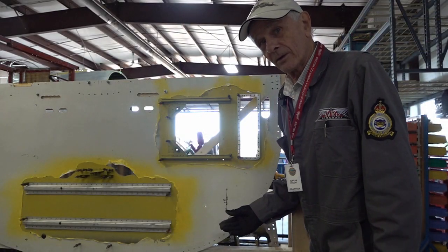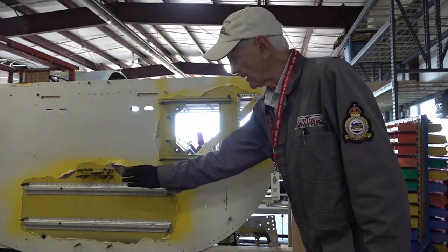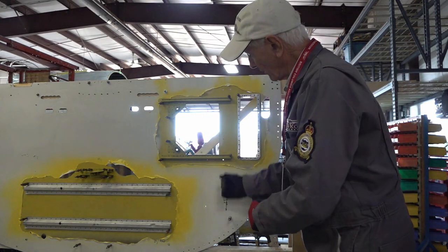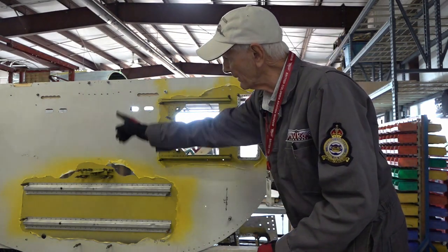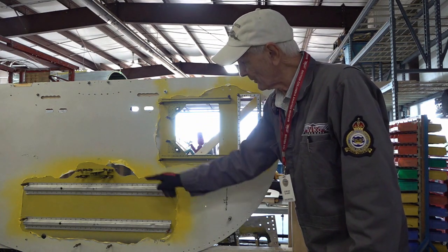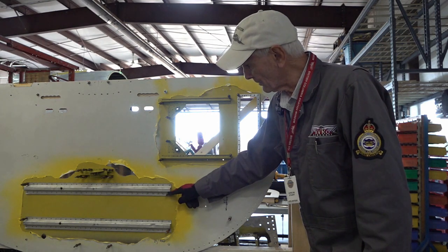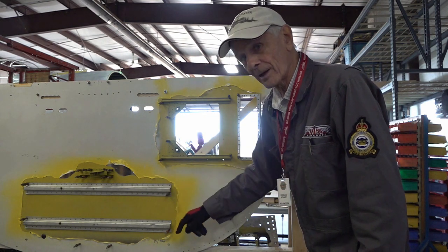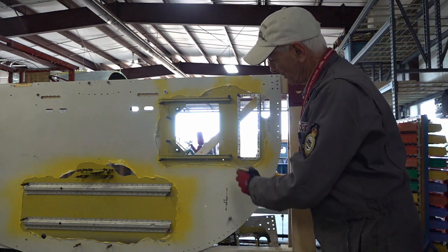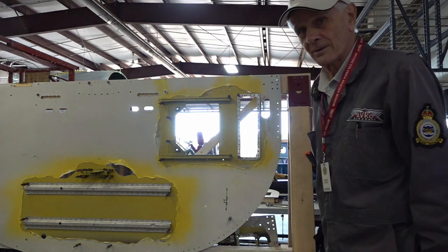And there are matching stiffeners going the other way on the opposite side. Now, as I mentioned, the stiffeners have to tie up with other stiffeners which are running in the opposite direction. The stiffeners on the front are going vertically in these various positions, but they have to link up with these stiffeners going across, which I have now done. It is very important, because if you don't get those right, all the holes will not match on the other stiffeners. So now the next step is to literally rivet all these various pieces in position.